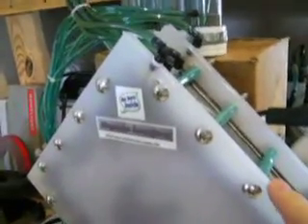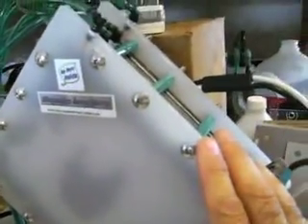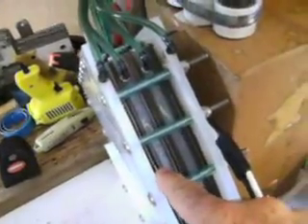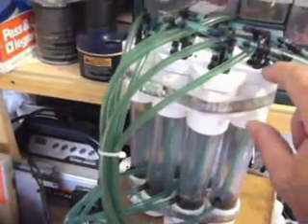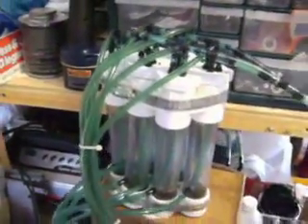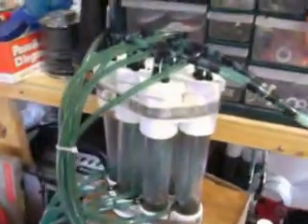The advantage of this design is 100% current isolation — there is zero, not a little bit, not a small bit, there is zero current leakage. Because the electrolyte from one cell does not ever come in any contact with the electrolyte from its neighbor. It's segregated all the way up to the bubblers, up to the top of the liquid level, and then by virtue of the gas outlet they are tied together — but the electricity supplying electrolysis does not travel through the hydroxy gas, it only travels through the electrolyte liquid. So that's 100% isolation.